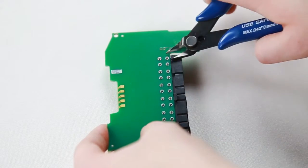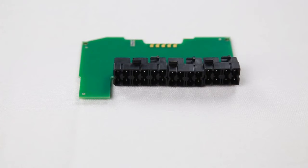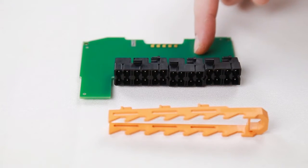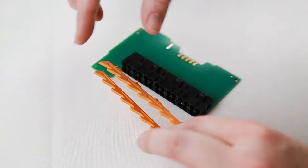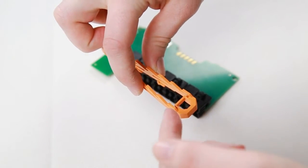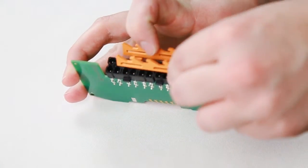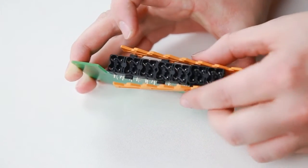But for the purpose of the video, I'm going to pinch the pins at the headers to hold them in place. Next, we're going to assemble the orange lock and release lever onto the headers. This orange lever aligns with the amount of connections that you need and must be selected as such. Make sure the orange release lever is in the correct orientation — the waves should be facing up and the bottom of the U should be facing towards you. Gently stretch the orange release lever open to line up the slots on the lever with the tabs on the headers. Snap the orange release lever onto the headers.